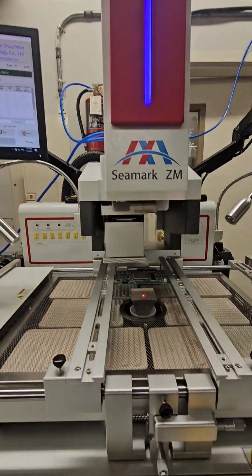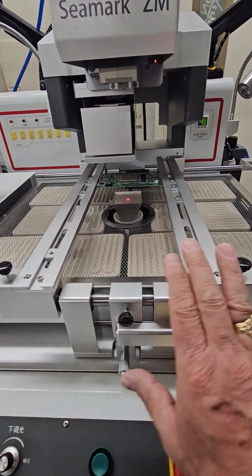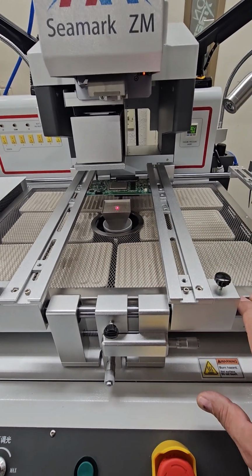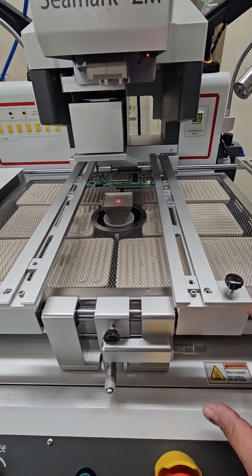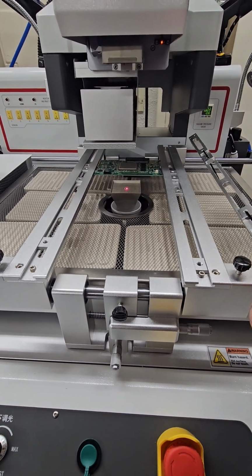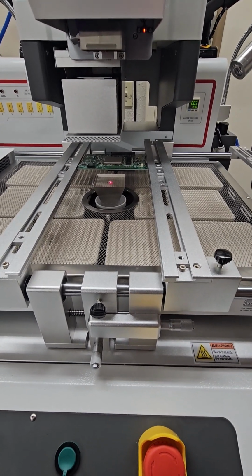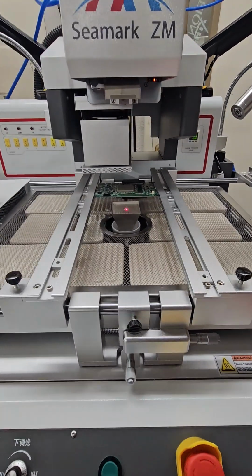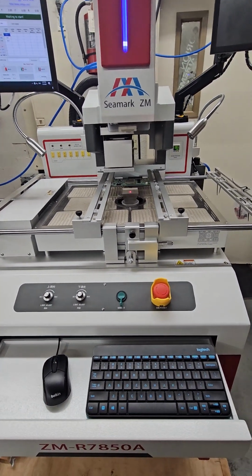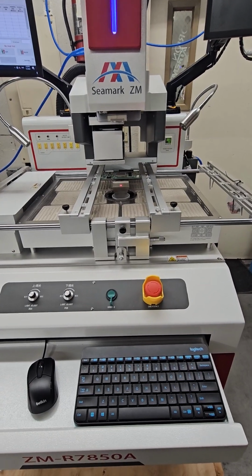And what we'll do is we're gonna put our board here, so you can put your board in and hold it by the jaws here, the guides. Or there's also hardware you can put in to hold the circuit boards by tooling holes. And then these are supports. If we want to support larger boards up to keep them from sagging, you have board supports. This particular machine, it'll hold boards up to 25-inch wide. We could modify them to go to about 30-inch wide if you need to.